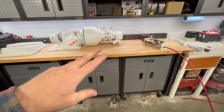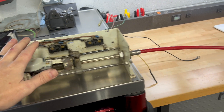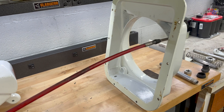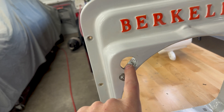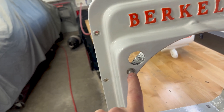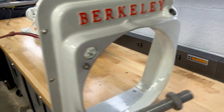We have the control box and motor up on the toolbox and we have the Bowden cable attached to it that runs back to the transom. Here's where it gets weird: you have to drill an additional hole below the original steering tube hole, and that Bowden cable bolts into the transom. You would have to take your normal steering tube out.